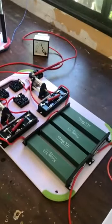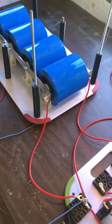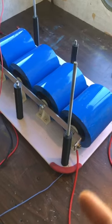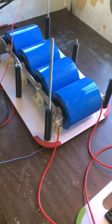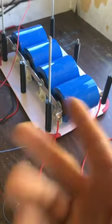If I made this system a disruptive discharge system it would be quite phenomenal, because it can fill that capacitor so fast in some of the configurations I've shown. We'd be dumping 60 joules at a rapid speed into a transformer — that's the original design. What's shown here can easily provide the power to do that at an exceptionally high rate, well beyond 60 cycles. At 2,500 volts we're blasting 12 kV into that like nothing.